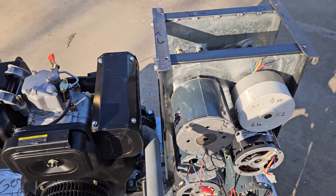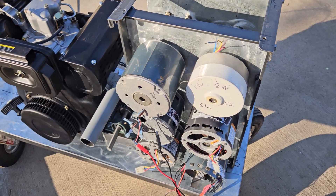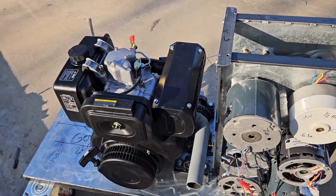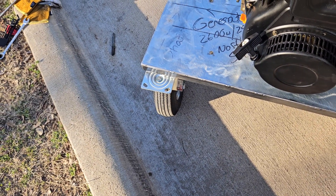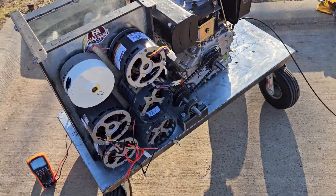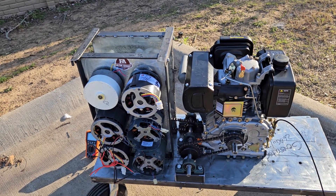I'm going to have a couple of accessories on this that need DC. I've already got a couple of 90-volt-down converters to make 12 volts so I can run some accessories — it's going to be a surprise, can't wait to show y'all. I'm also going to fix these mounting plates: I'll get some 3/8 plates, put six holes in them, and plate it off so it gets a solid foot. I need to spread them out on both sides because this thing is heavy — at least 300 pounds. You'd have to roll it on ramps or have three or four people to get it in a truck bed.